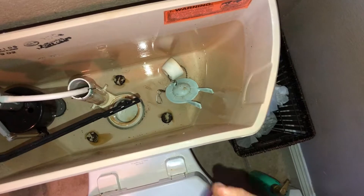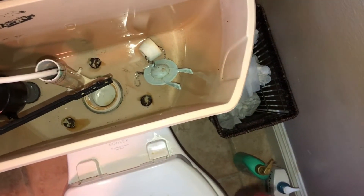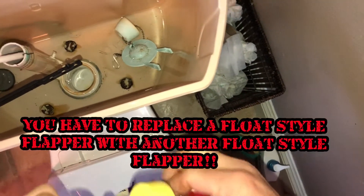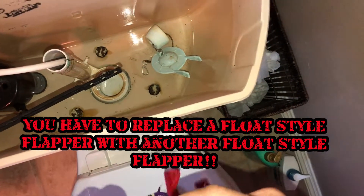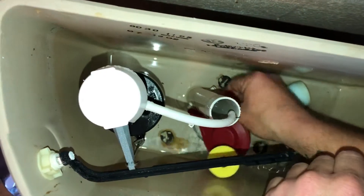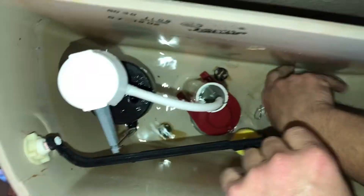So I'm going to put this flapper in. The way you do it is you unhook both sides of the old flapper, then slip both sides of the new flapper over those little prongs, those little hooks there. Take a rag and clean up the inside of the flush valve — you always want to do that to make sure there's no gunk buildup from the old flapper that could create a slow leak on your new flapper.